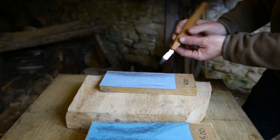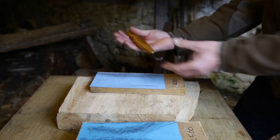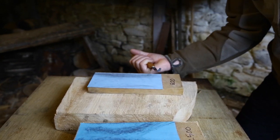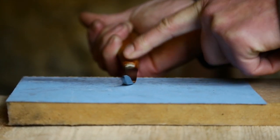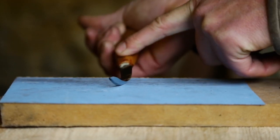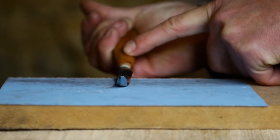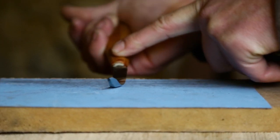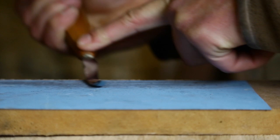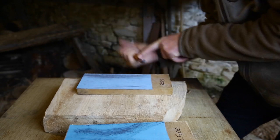A lot of people struggle with sharpening these hook knives, but actually they're remarkably easy. The technique I use is to hold the handle palm up like this. The crucial thing is to feel when the bevel registers on the stone — tip it forwards just until the edge just touches the stone, and with practice you can feel when that gets there. Tip it to there, hold the angle, and then you sharpen at that angle.